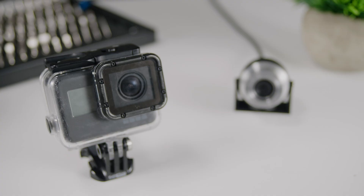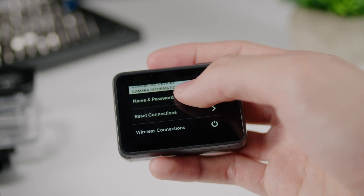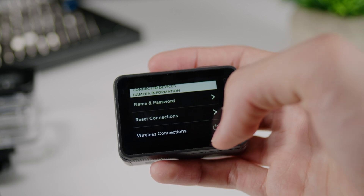Or, for most of us, we rely on action cameras, like GoPros. While these action cameras do provide great image quality, they're not the ideal use for ROV for several reasons. The first of which is physical size. Although they are generally pretty small, they do take up a good amount of space in comparison to the Explore HD. Additionally, their live video feed can only be streamed with systems such as Bluetooth or Wi-Fi, which doesn't work underwater. This means that you will have no idea what the camera is seeing, making it difficult to get the perfect shots.